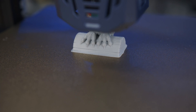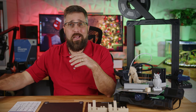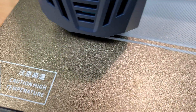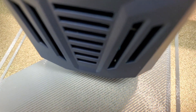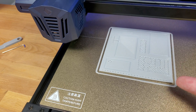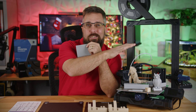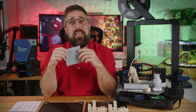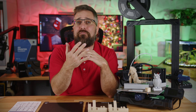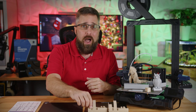Once I got the printer set up, I printed out the test dial that came pre-sliced on the SD card. The print came out okay, but when I tried printing a larger model that used a larger area of the print bed, the first layer was very inconsistent. I had to adjust the Z-offset and increase the initial layer width to get it to lay down properly. Even then, the right side of the print kept curling up. I ended up making multiple adjustments to the wheels to find that sweet spot. In the end, I scrapped the profiles provided by Anycubic and sliced the model using the default draft Cura profiles, then tweaked the settings as necessary to get the print to come out properly.